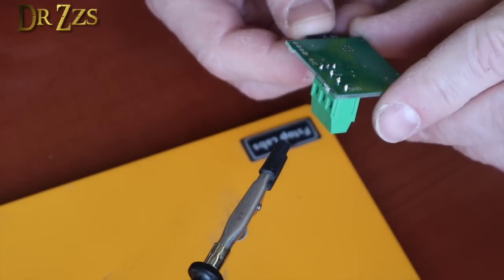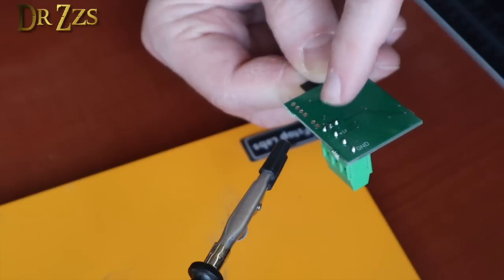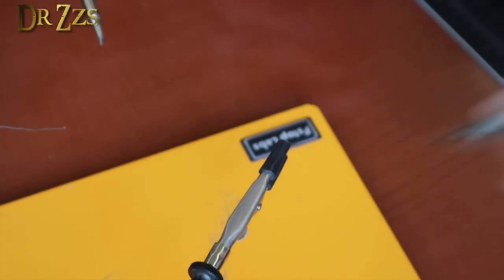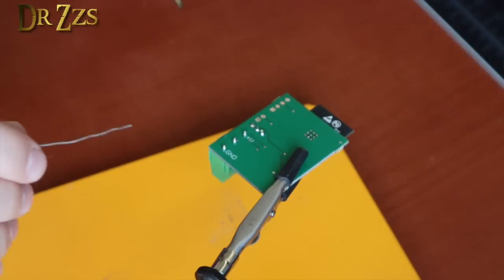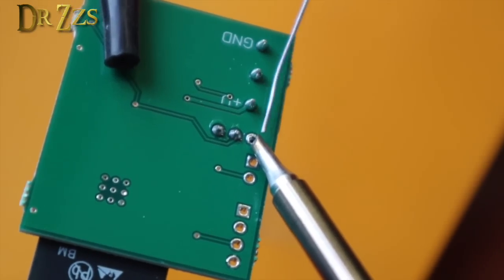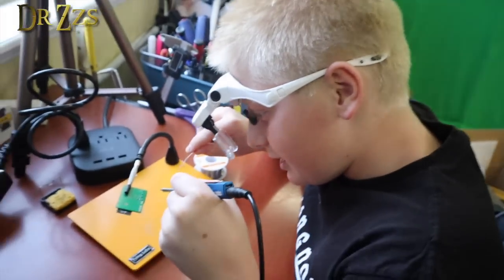That's not the most beautiful thing I've ever seen, but it's not that bad. You're resting your soldering iron on this hole right here — see what it did? It kind of melted that. So you want to be careful not to touch the soldering iron to anything else. Sometimes that means instead of laying it down really flat, you come in a little more at an angle from the top. But do whatever you need to do to make it feel like you're in control. One thing you'll learn too is that you don't have to push very hard with the soldering iron, and if you don't push very hard, it might not be quite so shaky either.